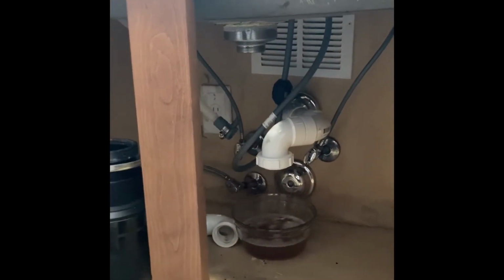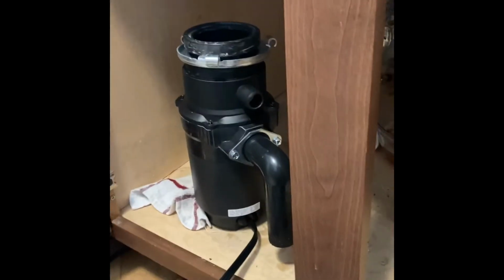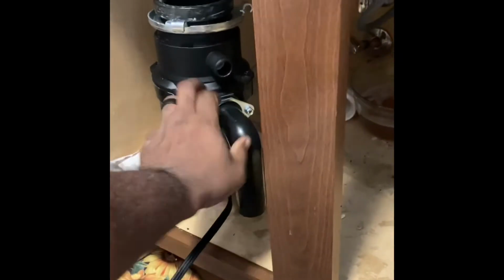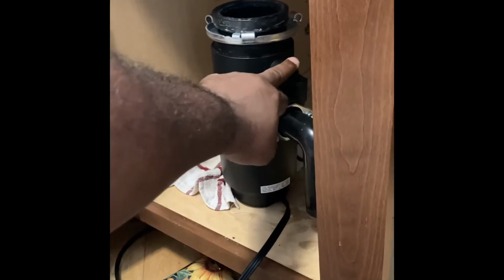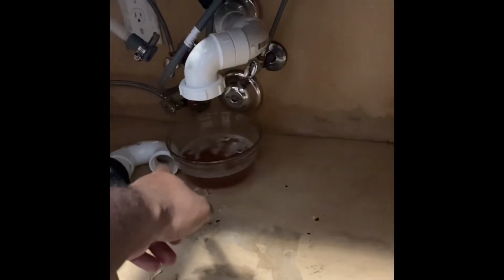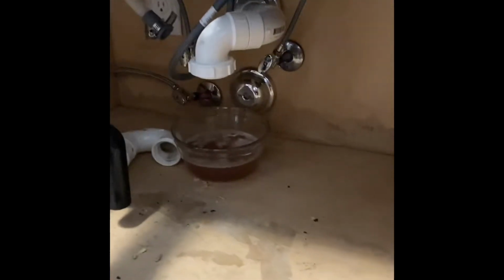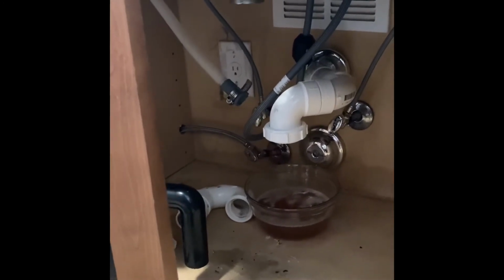And so what I'm going to do, all garbage disposals come with like two holes. I had to knock a white little tab out here. I've already installed this. This is the drain, but this is where the dishwasher goes. That will hook to the back of this. This right here will go inside the P-trap, and the P-trap will run up that way. Limited on what I can show you all because I'm videotaping this by myself.